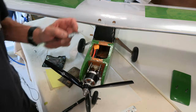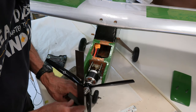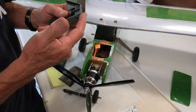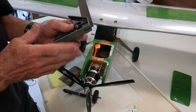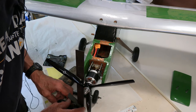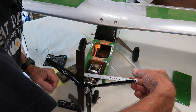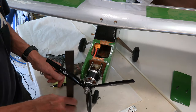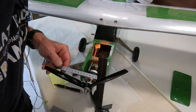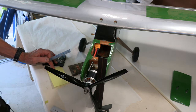Estimating the distance at the very end is always a bit of a trick. If you have something like a square and set it up so the vertical piece has got a little bit of a gap — making sure it's sitting flat on the bottom — and you've got a flat surface that you're working off of, line that up so it's right on the front edge of the casing. Measure out here, working carefully not to put any pressure on the plane, and that's about eight millimeters. Moving to the left-hand side, getting that on the casing and measuring back from there, that looks like about 15. So that gives me something to get started with.